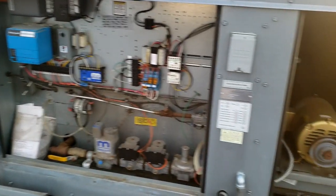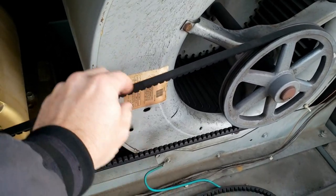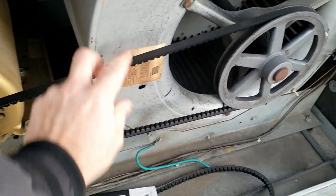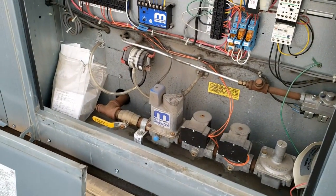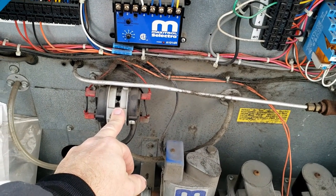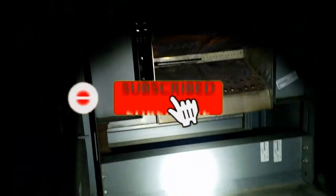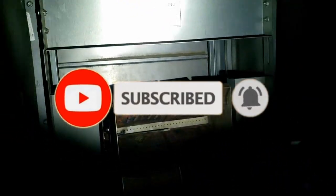I've done a couple videos on this unit before. It kicked on and squawked — the belt isn't super loose but definitely not as tight as it should be. This thing is fairly simple in design. You've got a pressure switch system that has to be right in the middle of its set range — can't be too low, can't be too high. It's measuring a differential across the burner, which is right there. There's a pilot system and a damper behind the burner, plus baffle plates that can be adjusted to get the proper differential.